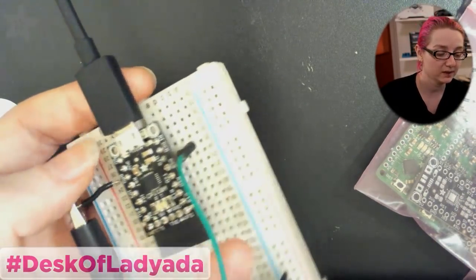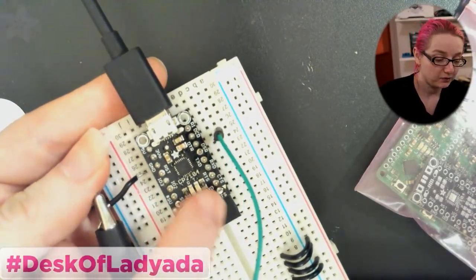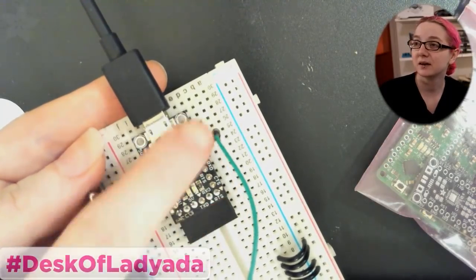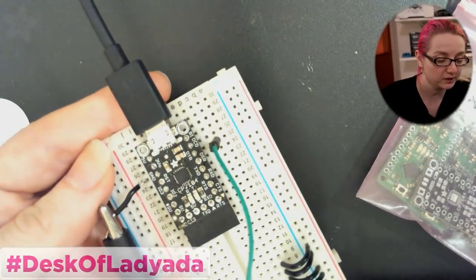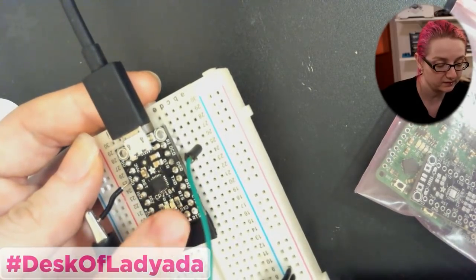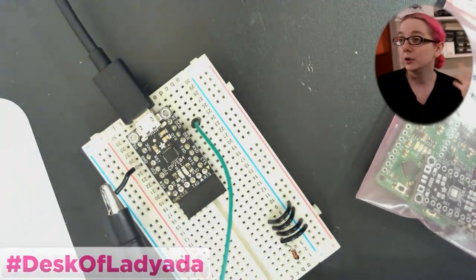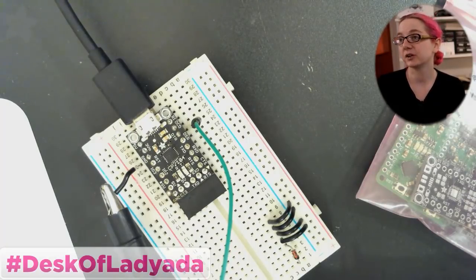And so here's the board, and this is the chip in the center. I put 2 LEDs, RX and TX, on here, and I'll talk about those in a bit. And then I've got GPIOs on all sides here, not the GPIOs, the control signals over here. Like DTR and DSR and DCD and ring and CTS and RTS. So this is kind of your standard USB to serial, 5 volt compliant, but 0 to 3 volt logic. Really good for all sorts of microcontroller interfacing.